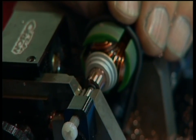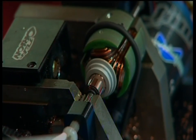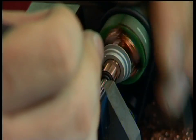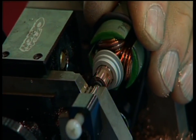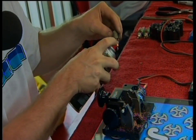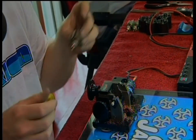You will see that the commutator is now actually clean — it's got just a little cut. And this cut is actually enough; you can cut the armature about 75 times. I just clean it with a knife. You can do it with a piece of paper also, it doesn't really matter. Take the O-ring off. Take the motor spray again. Clean it a little bit. It will dry automatically so that is not a problem.